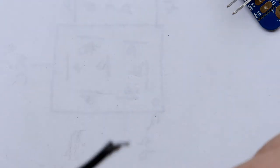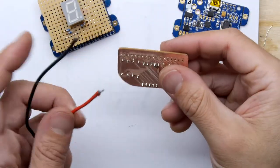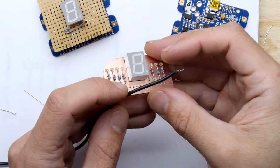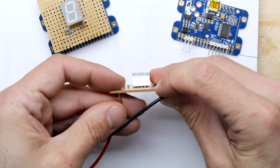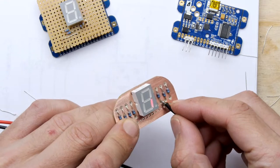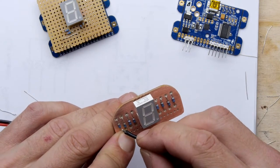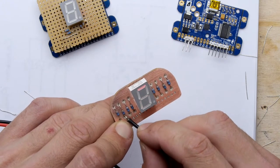So I'm just going to test this. I have to have 5 volts at pin 3. This is where it's trickier, because here it was easier to get at stuff. I'm just going to zoom out, because I might have to hold it at a weird angle so you guys can see it at home. So I know where the 5 volts is. It's there. And I can do the other bit, probably, from this side. Yes. So that's those four. So we've got two going off there. So we're getting...